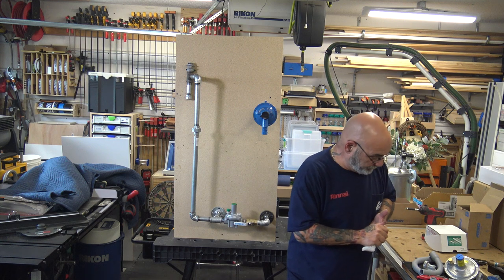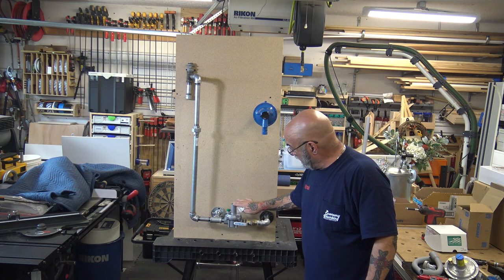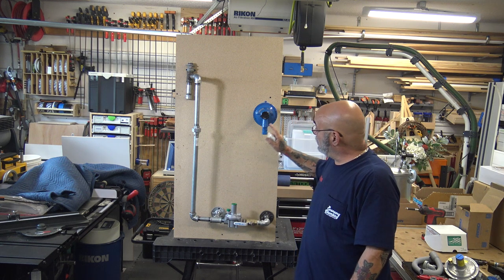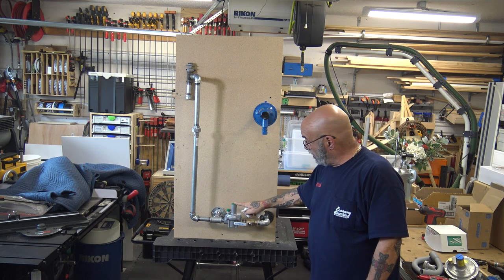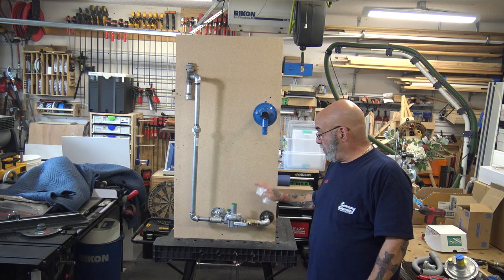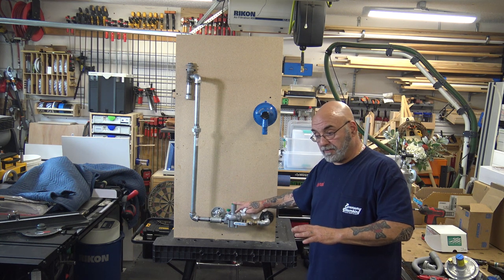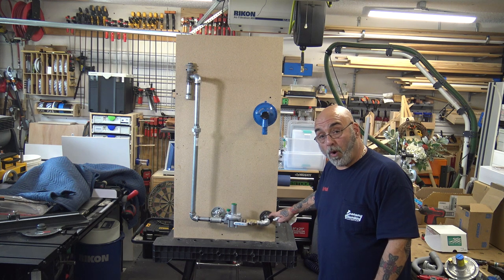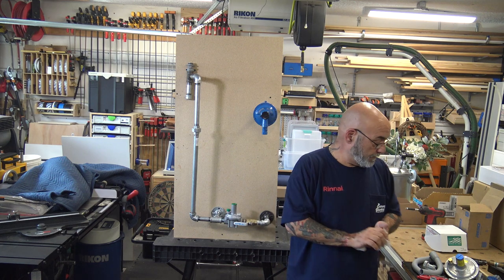So that's that. Again, valve, regulator. Now it could be one of these. Just say you only have a tankless. You can get this regulator, which is a straight through 3/4, and that would go here if you had 10 pounds coming up out of the ground. But if you have 2 pounds or under, this Pietro, this end could be natural gas or propane. This regulator will handle it. It's designed for both.